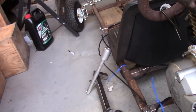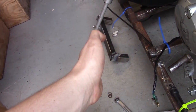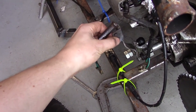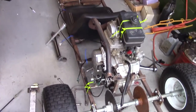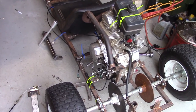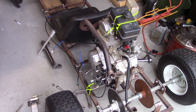I'm going to put the shifter on the left side of the cart and then simply run a straight linkage — just a straight bar from the shifter straight to here, one of these holes probably. And that will make it incredibly easy to shift without having to use two cables and hook it all up. It's going to be a little weird using your left hand to do that, but at least it will keep my dominant hand on the wheel and take much less time to fabricate, and will probably work better as well.